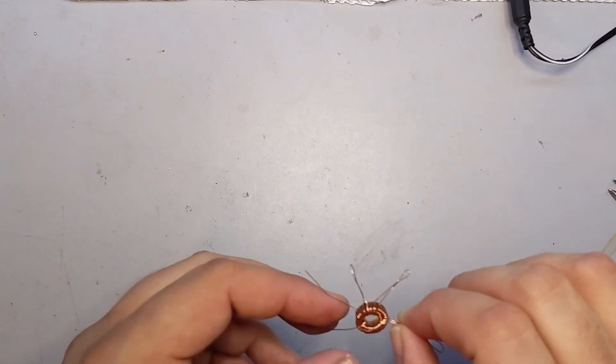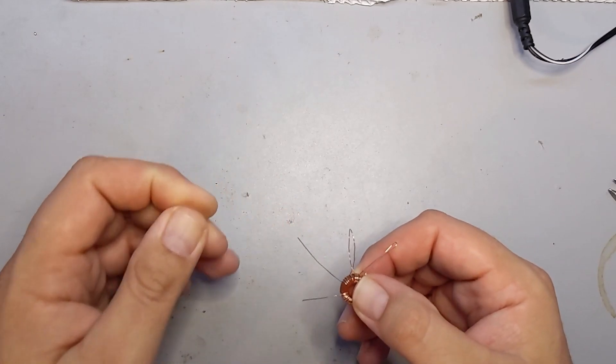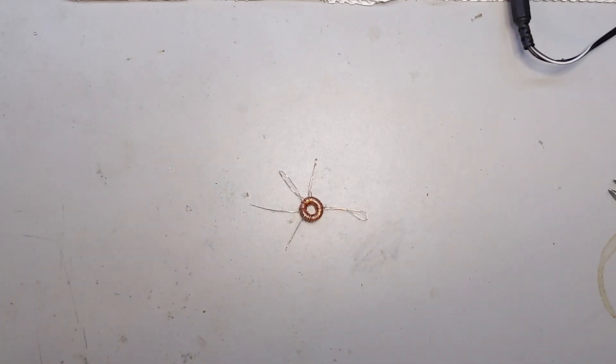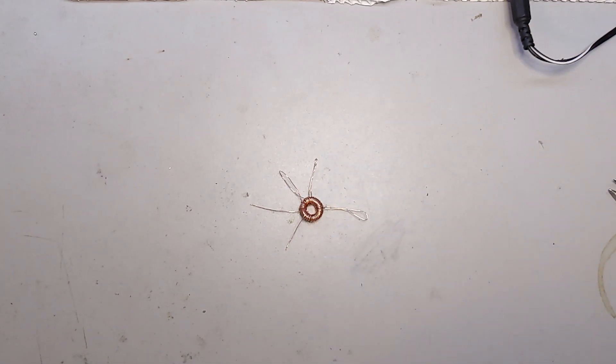This is pretty easy. It's delicate and a bit intricate — maybe tedious — but not difficult at all. If you can do 41 windings and just remember to leave three of them hanging loose as loops, that's good enough. Here's L12 ready to go for the QDX when it arrives. It's really going to be pretty easy to put together — it's mostly some inductors, some passives, and a few other parts.